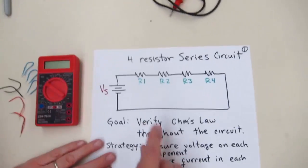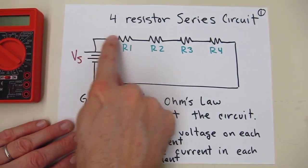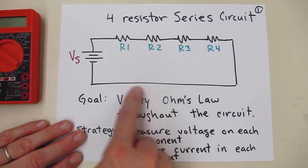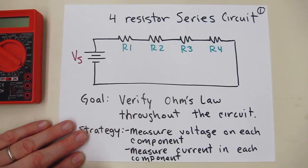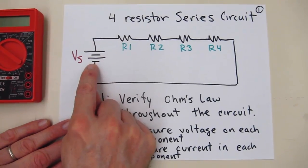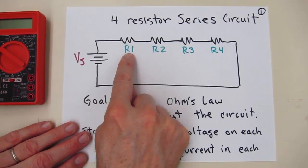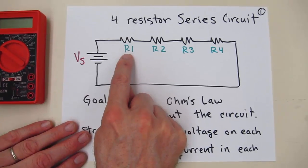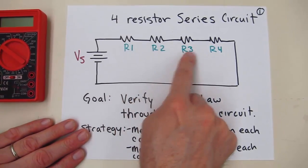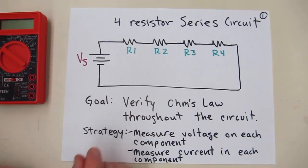Back to the circuit here. What we want to have set up is our voltage source driving our four resistors in series to complete our current loop. This voltage source is going to be our UNO32, and then we're going to have these four resistors — the ones we've got are just around 500 ohms. So we're going to have four of them in series. Let's go ahead and set this circuit up so that we can take the measurements we need.